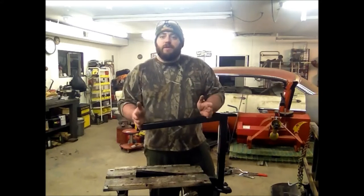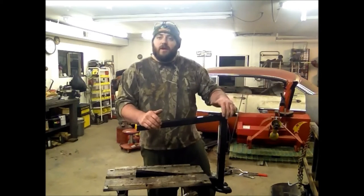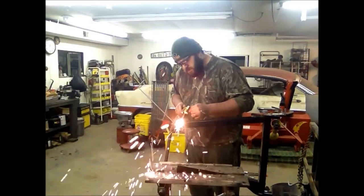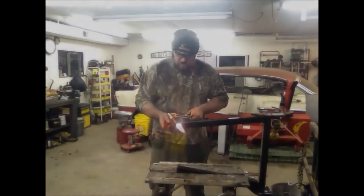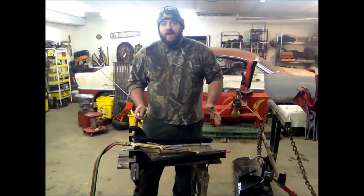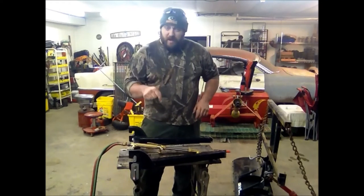Because I've saved this, I'm able to use the same tubular steel that the snow plow was made out of to weld up the bracketry and the cross bracing to make this a little bit stronger so it doesn't get bent one more time. I'm going to go ahead and cut the angles on this that I want and get ready to start welding it to the plow frame. We're going to cut it off with a little bit extra so we can get this welded on and then clean it up. Stay with me, I'll show you what I'm up to. Let's go.